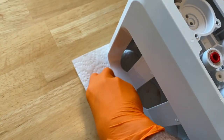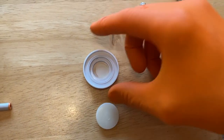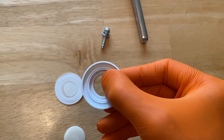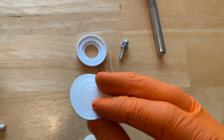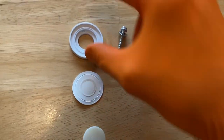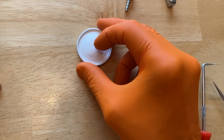I'll tip it upside down and it should just fall right out. I'll set these aside and talk about that flow restrictor shortly. Here is the internal diaphragm housing. You'll notice a little cutout right there, and on top you'll see a hole — it should not be obstructed. Here's the inner diaphragm portion; they feel like rubber and that basically rests inside here. This outer diaphragm fits right in place, and this works literally as a diaphragm works through the pressures within your system.